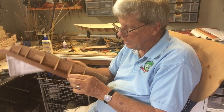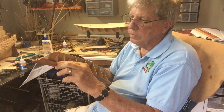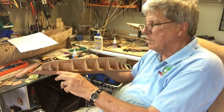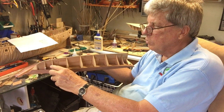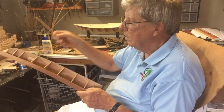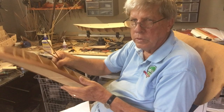And then you take the distance, not at the bow, but at the rib inside from the bow, and I've taken the distance on the second one in. And then you divide the distance on both of these ribs by 14, and that will give you the thickness of the taper at these two points. If you wanted to be fairly sophisticated, you could actually work it out for each one of the ribs, and you'll find that it will not be a straight line. And you cut the rib to size, and then simply put it on a cutting board and cut out the ribs, and you'll get a tapered rib, which should give you a fairly accurate way of going back and forward.